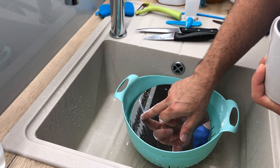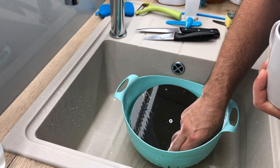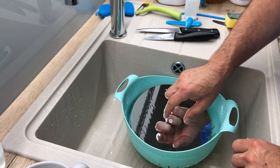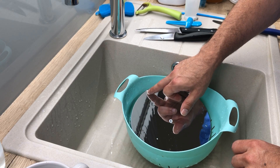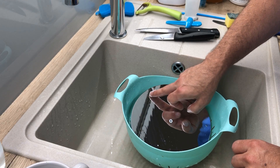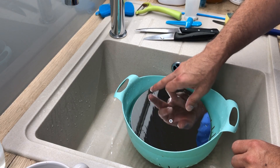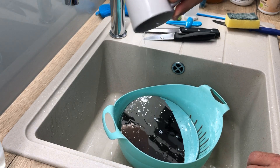This way, if there are any specks of dust, we can feel them with our fingers and we can avoid scratching the surface. This is where most people get this wrong — do not ever use a cotton swab to do that. Here for example, I felt a small speck of dust and it felt like a big stone, so I had to stop my finger. Had I used a cotton swab, I would not have felt that and I might have scratched the mirror. Keep in mind that the coatings of telescope mirrors are at the top of the mirror, so it can be relatively easy to scratch it.